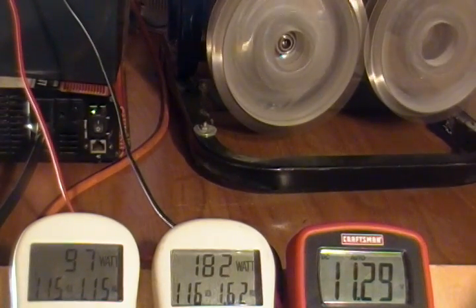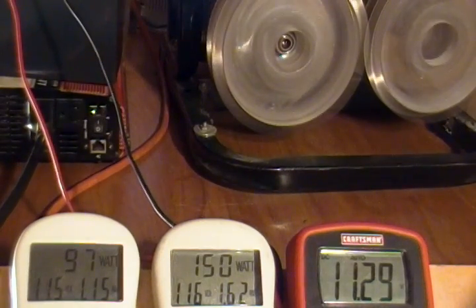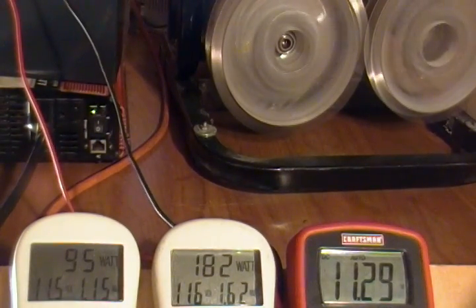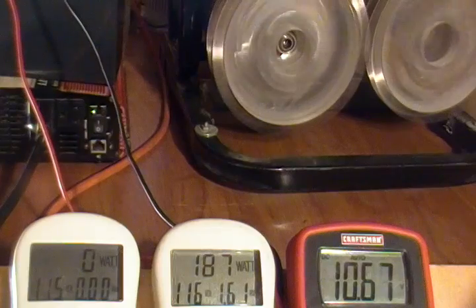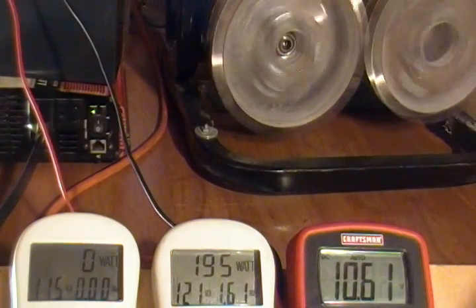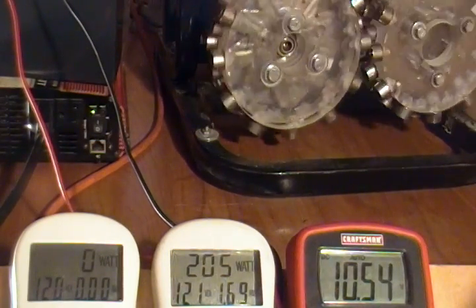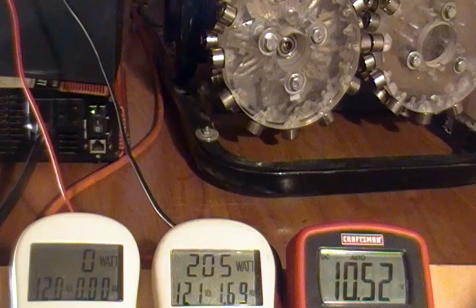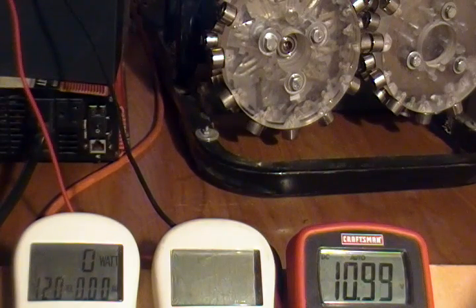I think we've let it run long enough. You can see that the amount of power being produced is greater than the amount of power being consumed, and I'm slowly building up power in the battery. I'm going to shut it off now, and you'll see how the power in the battery is quickly consumed — to the point where the alarm will go off on my inverter as soon as we get under 10.5 volts — and there it goes. So thank you for watching.